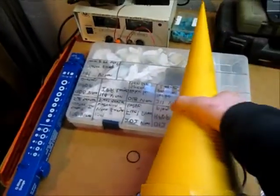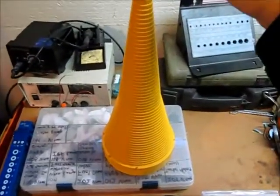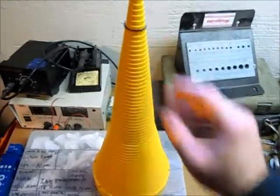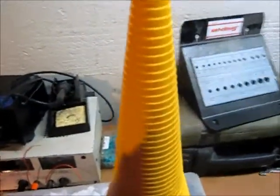I actually bought two tools. One is this cone. It starts out real small and goes down in steps, and at the bottom there are these little notches. What you do is you first line your O-ring up in the notches and find when it fits. Then there's a correlating scale all the way up the cone. You just drop the O-ring on, put it down until it stops falling and is even, and then you can read the number. It says 020 for that O-ring.